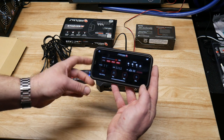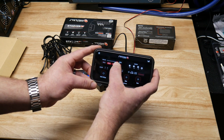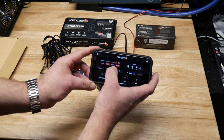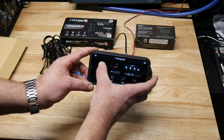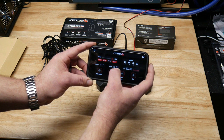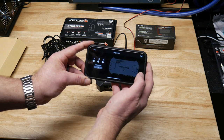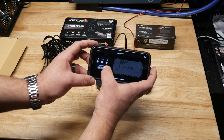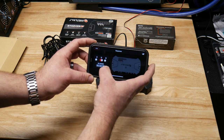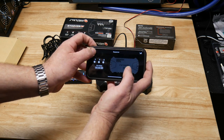On the home screen you have everything laid out a little differently. You've got your main level right there, and then you can change the level on individual channels — like channel three, channel one — via sliders. It's kind of like a quick access menu. It shows if your limiter is going on or off. Here are your sequencer settings: you can set sequencer one to delay three seconds, sequencer channel two to delay four seconds, and toggle them on and off. Pretty basic.